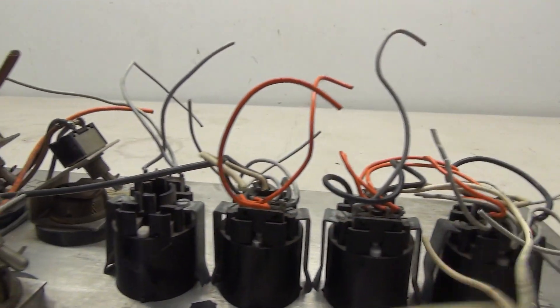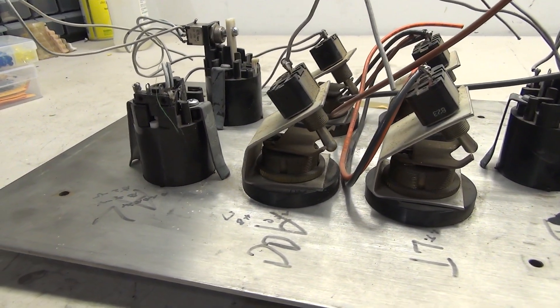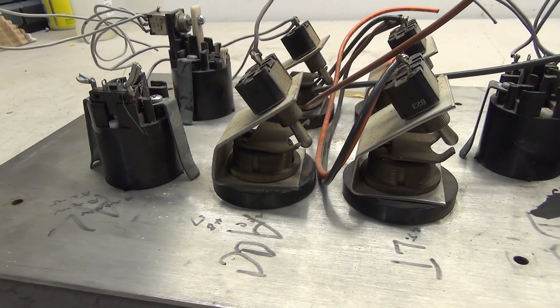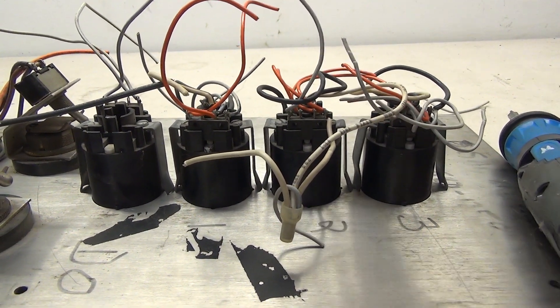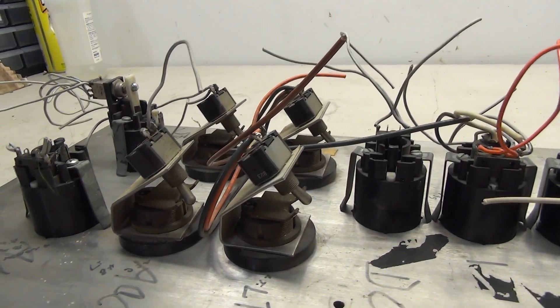I just need to connect all these together. I'm also going to be adding in an alarm beeper — I haven't tried these beepers out yet, so they could be really great or they could be terrible, I have no idea. I will have to solder some new wires onto here to attach the beeper somewhere. As for the lamps in here, I don't think that they are low enough voltage to run off 9 volts, so I'll put some new bulbs in there — some lower voltage ones that will light up just nicely. So it is time to start with wiring.